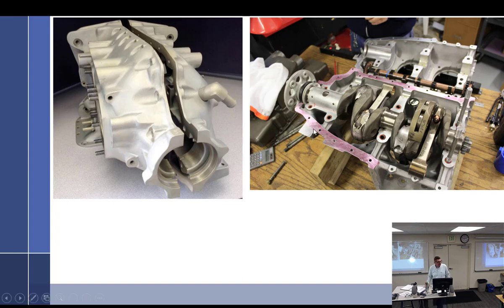The silk thread does have a sealing property — it smashes flat. When you take apart an engine that was assembled correctly after many years, you can still see both pieces of silk thread, flat as can be but still there and still sealing after all those years.